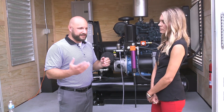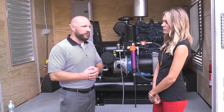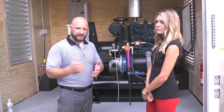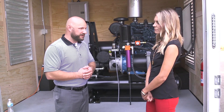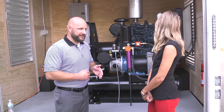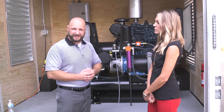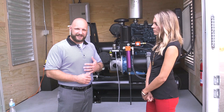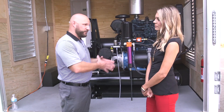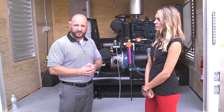Regulating your air pressure is something people don't always care about or talk about. I've seen countless rigs with all the equipment basically taking the air pressure coming right off the compressor — on a gas air compressor, that could be 150 to 175 PSI, way too much. Regulators cost money, so some people don't take that into account. But we don't get to dictate what spray foam needs to be processed properly — we build it in accordance with what is needed to make quality spray foam, and clean dry air is one of those things.